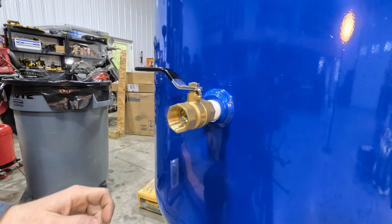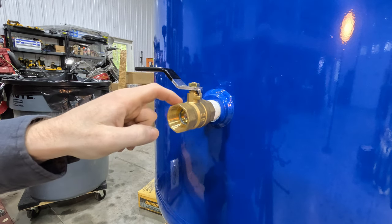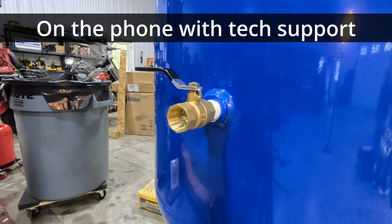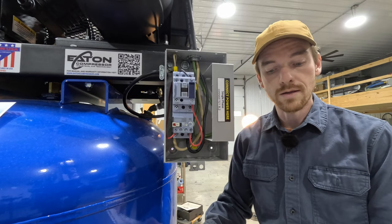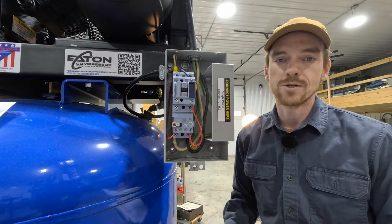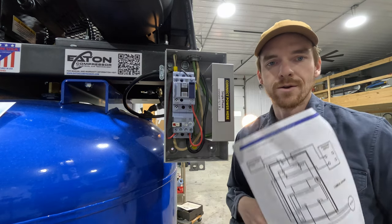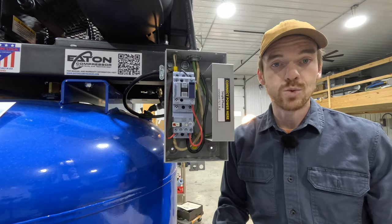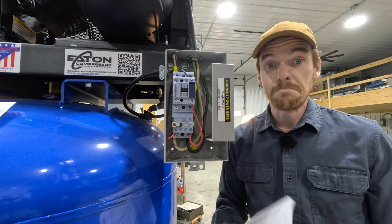The first thing I'm going to check is the air fitting. I think it's a one-inch fitting — one-inch national pipe thread. The other thing I'm going to need to do is wire this up. This is 220 single-phase power. They need a 50-amp circuit, which I have already set up, plugging it right into the wall for now. Eventually it's going to go into a secondary breaker box. According to the manual diagram, I just need to put two hots up here and then connect a ground wire to the back with a six-gauge wire, and then get the correct plug for that too.